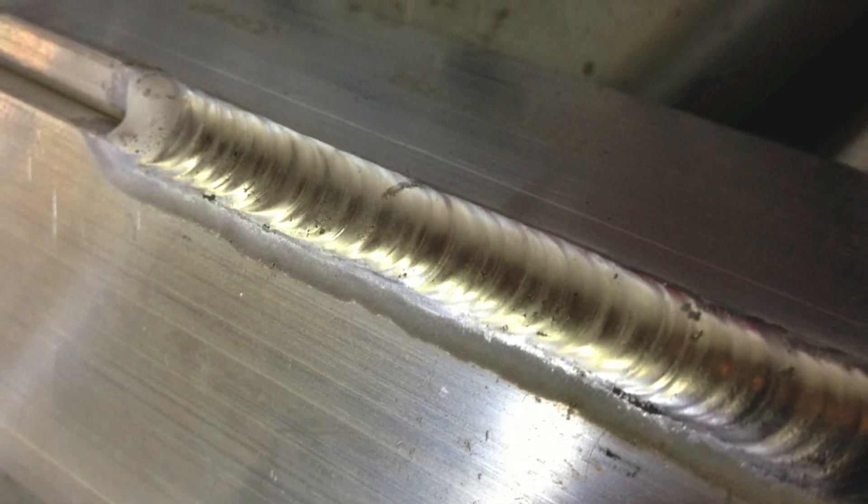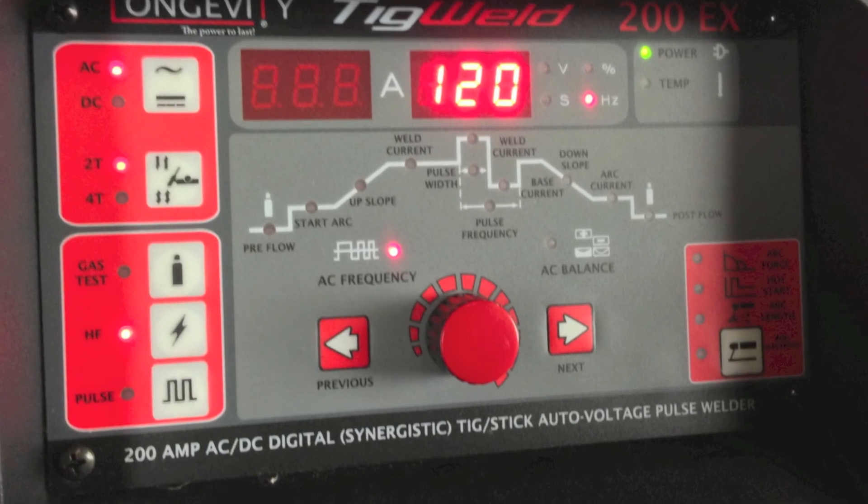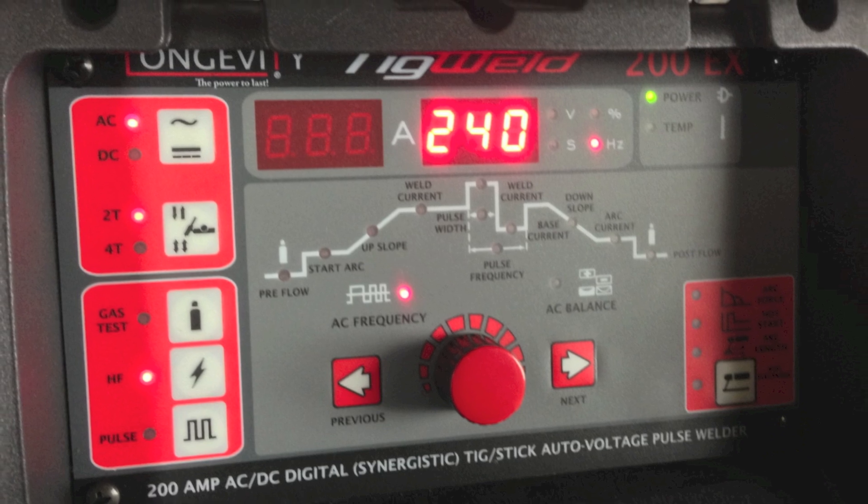There's the appearance of the corner joint after I got done. I made some small adjustments to the machine — one small section at 120 hertz, then finished the weld up at 240 hertz. We can hear the change in the arc as we increase the frequency rate. The arc becomes more focused and the bead slightly narrower. I tried to keep it full and then taper off at the end so as not to leave a crater crack.